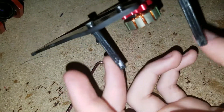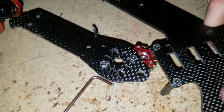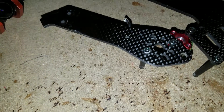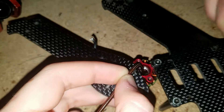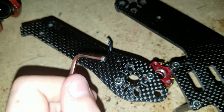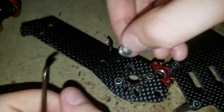I set up this little thing here with some standoffs to hold the motor off the table a little bit, so that way I have some space to get the top bearing out. There are obviously much more practical ways to do this, but this works. And wow, that was easy — there it is right there. There are no bearings in that motor now.